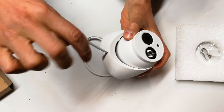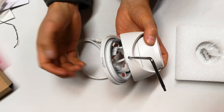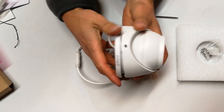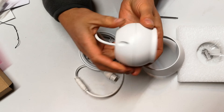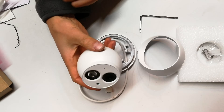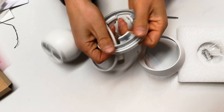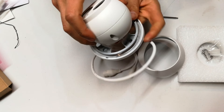You'll need to loosen the adjustment here. This is a tamper-proof IP camera — as you adjust it, you can see how it opens, with that screw actually wedging in. The camera body itself is IP67 rated. To get an IP67 rating, your device must be able to be immersed in water up to one meter — so this is fully waterproof to one meter. To mount it, there are four holes, and it's solid steel — much more rugged than the plastic cameras we're used to nowadays.